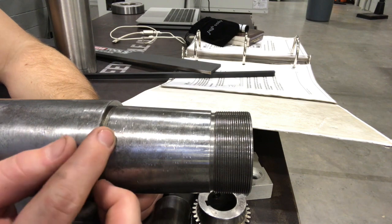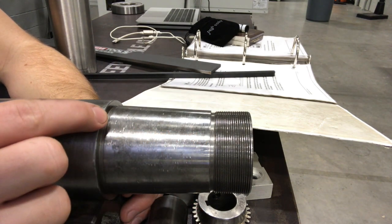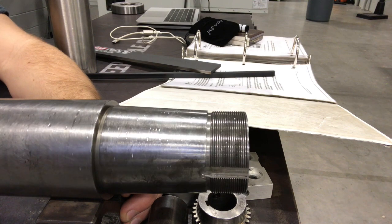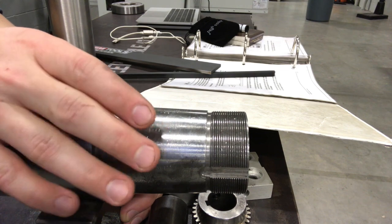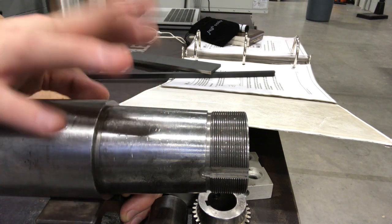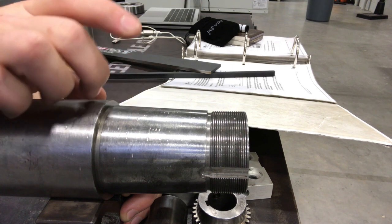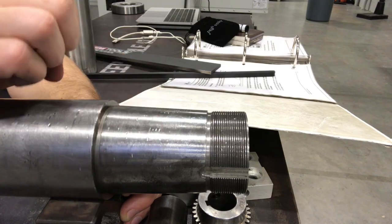While we're on the subject of inspecting flat surfaces, take a look at this one — you can see there's a bunch of little dings and dents all throughout this shaft. What's happened is probably through installation, people have just beaten the crap out of this thing. If you start seeing a lot of this, go ahead and look at getting that shaft repaired. Most of the problems we have are from misinstallation. Just don't be that guy, especially not out in the field — you don't want to explain to your boss why something is wrecked.